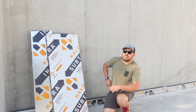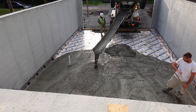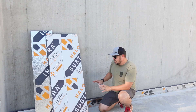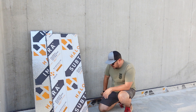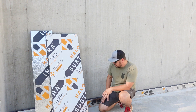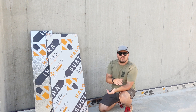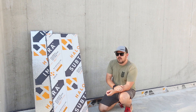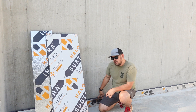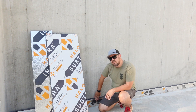It meets the IRC code and we're not really worried about it. We have the two layers underneath the slab of the Halo Subterra, and that product is specced to be able to be below grade. We have the Intera on the sidewalls here, and you can see about 6 to 10 inches of it sticking up. What we've learned is the reflective face on that can actually reflect and affect other pieces of insulation — we could get some overheating and a little bit of melting. So we didn't want to fully cover our walls yet because the first floor is not on here yet. What we've done is a 12-inch rip, and that gave a solid point for us to make a connection from our vapor barrier underneath to our vapor barrier on our walls, which will be the Intera product.